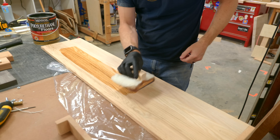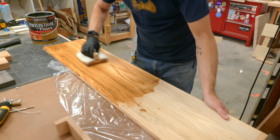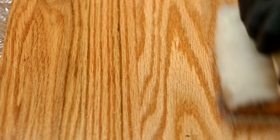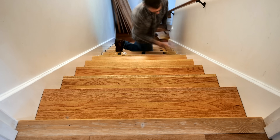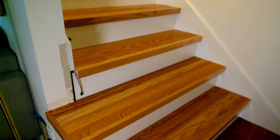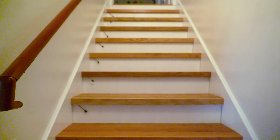The steps are spread out around the shop and ready for finish. For the finish I'm going to be using a polyurethane made for floors — the same stuff you'd use refinishing hardwood floors. It only takes a couple of coats, but I'll probably do three or four, spacing them about four hours apart with very little sanding in between. It's a pretty simple process — it just smells bad and takes a while. The stairs are pretty much done at this point.